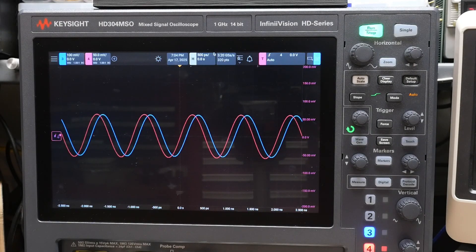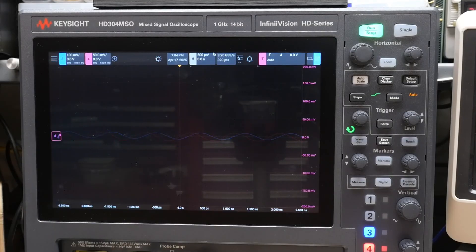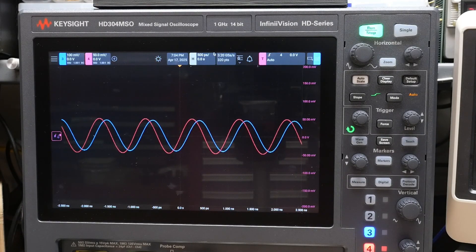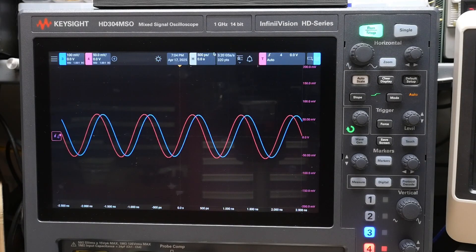It's quite interesting. I'm going to increase the frequency, and right away it's starting to fall off. It stops working at around 1,050 to 1,090 megahertz. It is only a one gigahertz scope, so I can't go any further. I'm also not quite sure how to demonstrate the 90-degree phase angle without a four-port network analyzer that goes to 2.2 gigahertz — that would be the right way to do it, but I don't have that equipment. This will have to suffice, but you can see the device does provide some type of phase shift dependent on frequency. That's what it's supposed to do — this phase shifty thing.